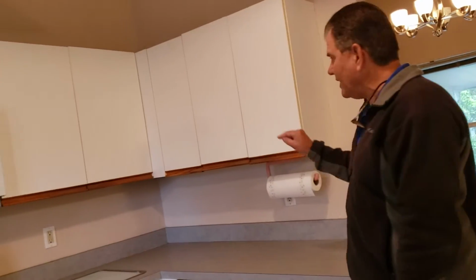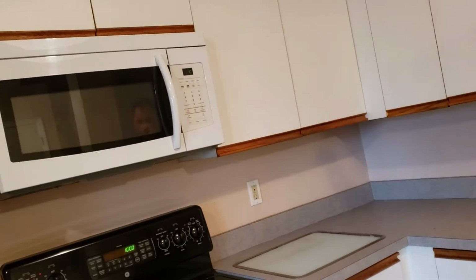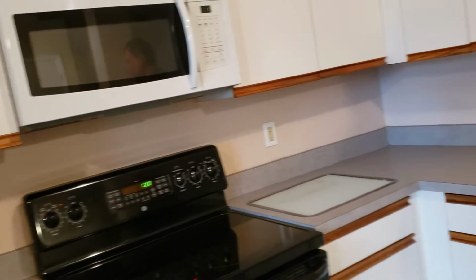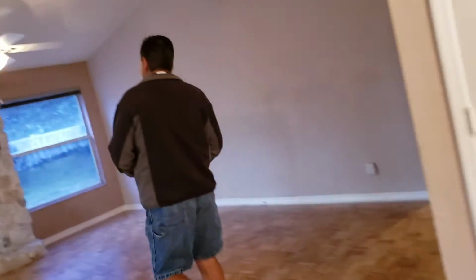They put GFIs on every outlet. They don't understand the concept of a slave working off of a GFI. So the original GFIs in every one, well, they put GFIs in every outlet, so when it trips, it's going to trip them all off. So just replace them as they fail. Okay. Nothing to be concerned about right now.